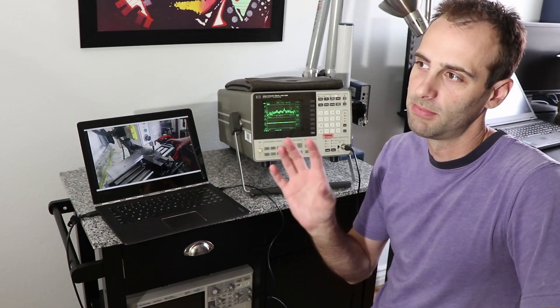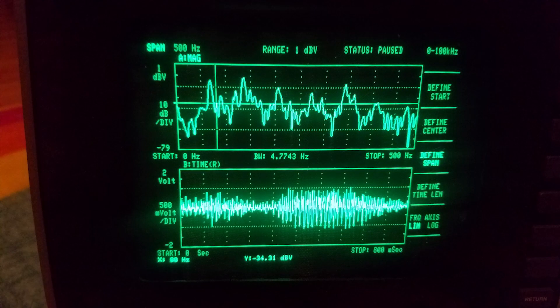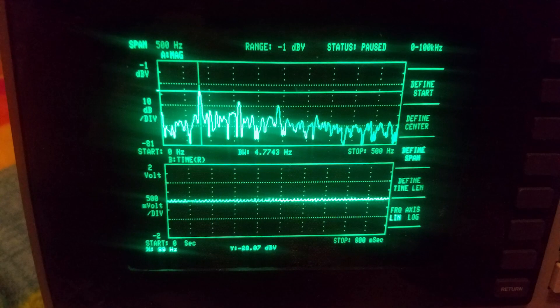You can see a couple things right off the bat: first, the resonant frequency clearly went up — mission accomplished. The other interesting thing is when I was talking about the knob not being as sensitive to resonance after compared to before — on screen we have a screenshot of the before, and using modal analysis looking for peaks along the spectrum, there are a ton of them all at similar amplitudes. If we look at the after picture, there are clearly defined peaks and clearly defined troughs. What that means is if we keep excitation frequencies in the troughs, we're less prone to excite one of the major resonances.